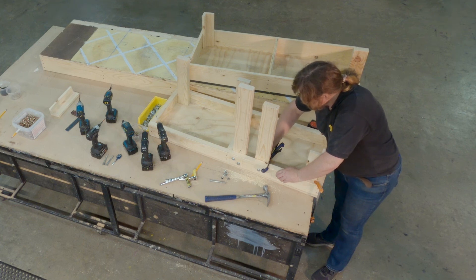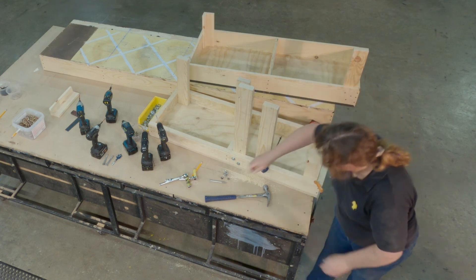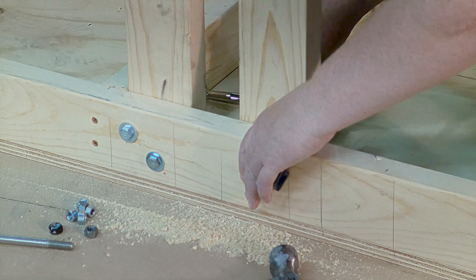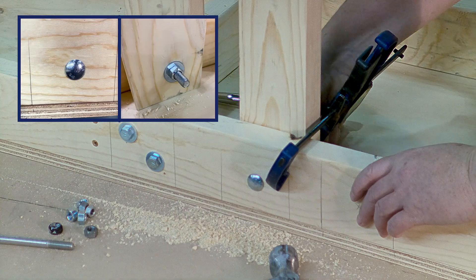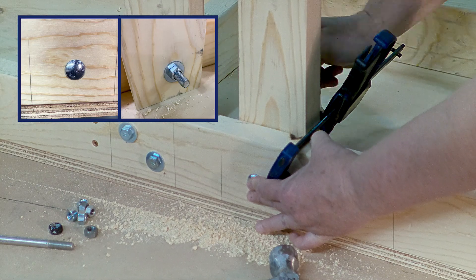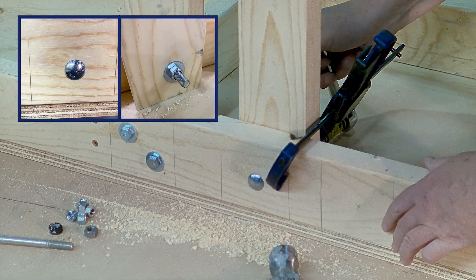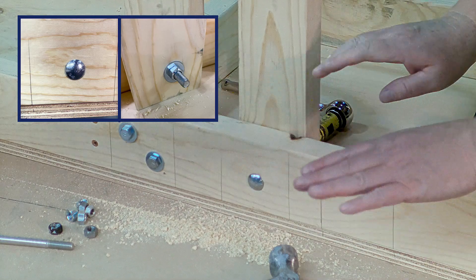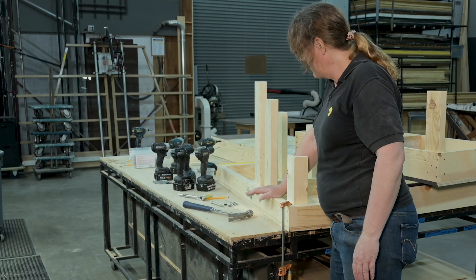This one is a little bit damaged — I'm a little leery to use it, but we'll find out what happens. Those threads on the end were kind of damaged. I tighten it down, but overzealous stagehands will just keep tightening and tightening. I try to get it to sink a little below the surface. But even with this, the round head is still proud and it's not going to allow us to butt two platforms together — that can be a problem. So we really need to do the countersinking.